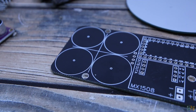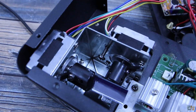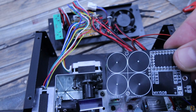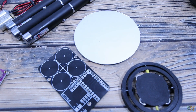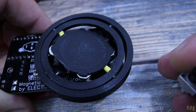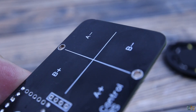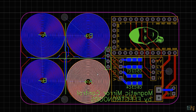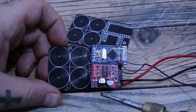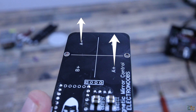The final part and topic of this video is how to move the mirrors in the X and Y directions. The commercial machine is using stepper motors, but I think that these are quite slow, noisy, heavy and bulky. So I'm trying to make a better solution and that's why I've made this PCB for this project. The idea is to place the mirror on a 3D printed structure and then move the plastic part using magnets and electromagnets. The PCB has 4 coils — I've made it with 2 layers so we have the coil on the top layer but also on the bottom layer. The PCB has space for an Arduino Nano and an H-bridge module. Using the H-bridge and PWM signals from the Arduino, we can control the magnetic field that the coils are creating and by that we can push stronger or weaker onto the magnets.